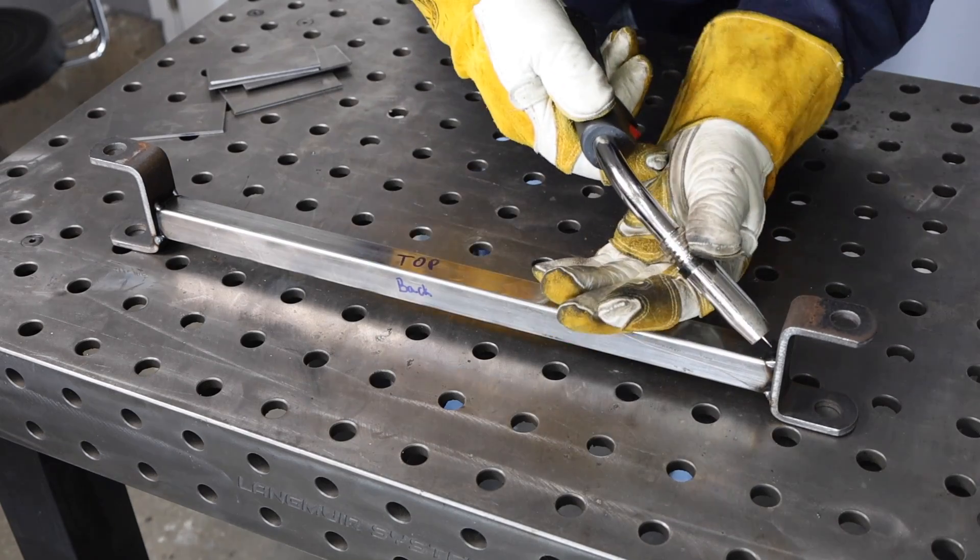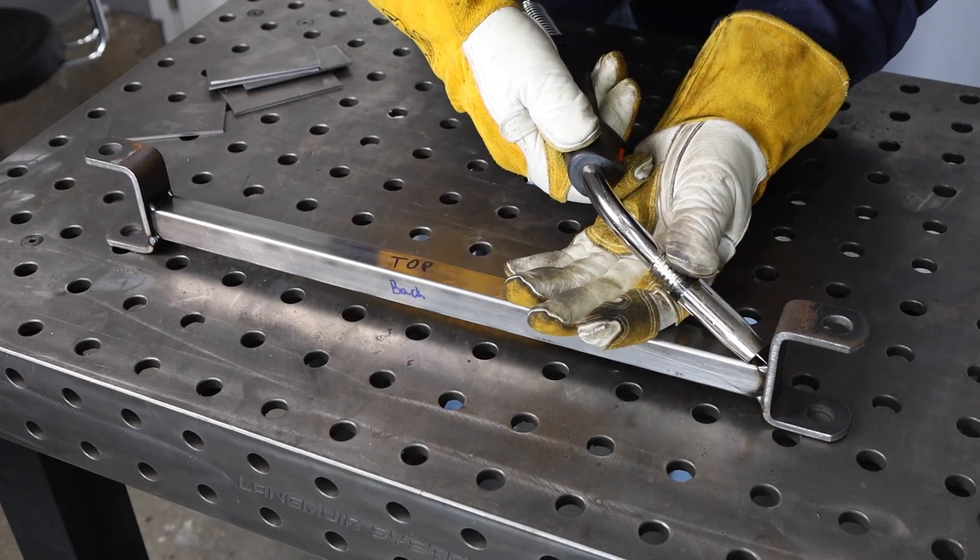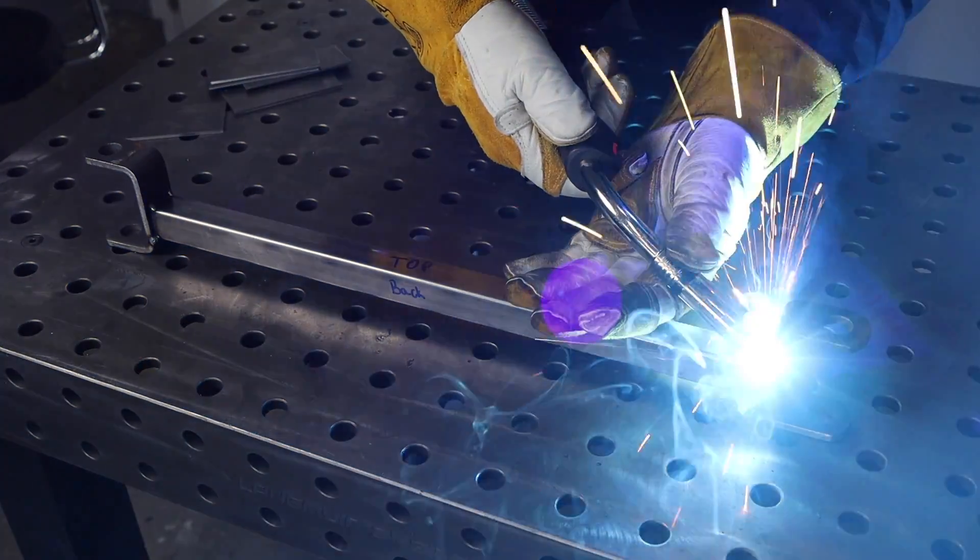Now that we've talked about the basic principles, let's look at the examples from the go-kart project. Welding this front axle together with these axle brackets is exactly the same thing. Watch as I weld along — I'm just letting it fill in from that thick material, rolling up onto the thin material. Because that thin material can absorb and transfer so much less heat, it comes out nice and even, even though I'm positioned just slightly to the side of the thicker metal.